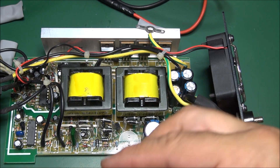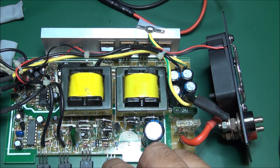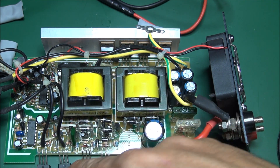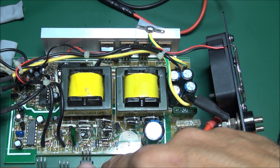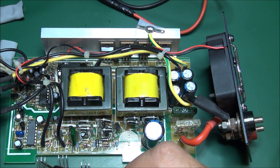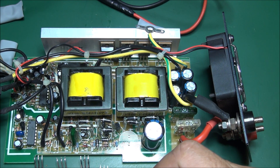Apparently this output stage, which generates the AC output, is faulty. It remains to understand why these transistors failed. To check whether there is a faulty signal driving the gates of these transistors, you need to verify that there is no continuous DC signal on the gates before purchasing new components and attempting a repair.